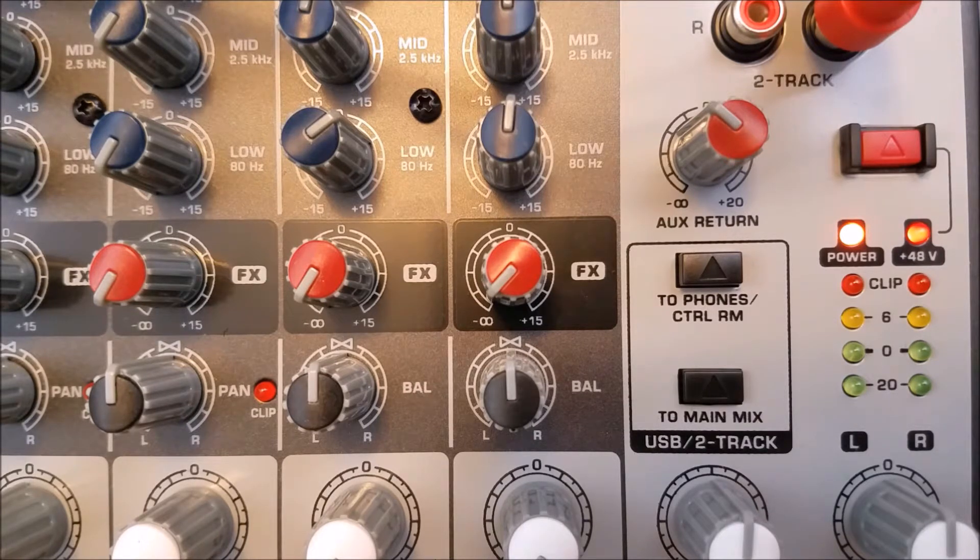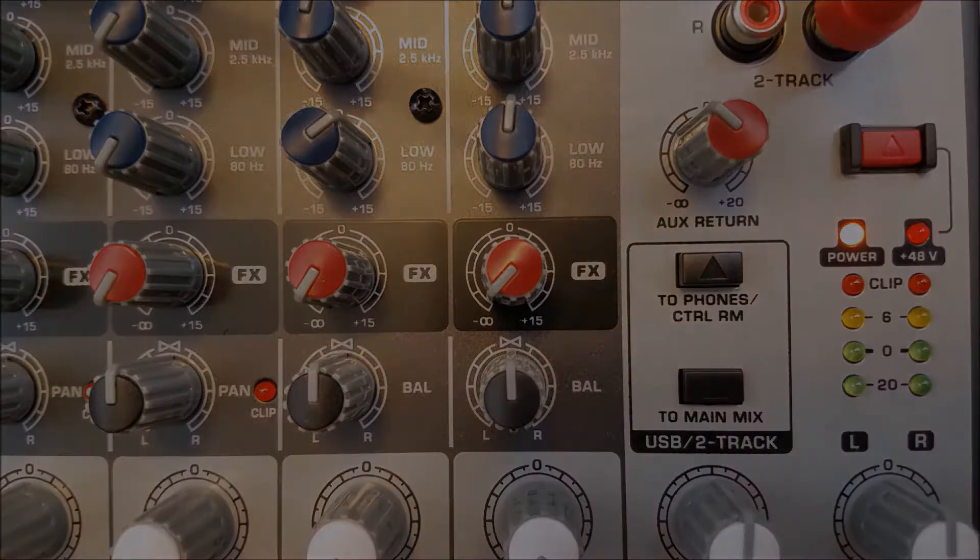I emailed Behringer and haven't heard back, but I'm curious how that works. I learned this by leaving the room for a coffee break — when I came back the light was off. Whatever is inside that powers it up discharges over time. I also noticed that if you turn it off and start talking into your mic while waiting for it to power down, as that light fades out so does the sound. So when they say the power button light doesn't go off, it will eventually — it just takes a while to discharge.